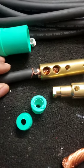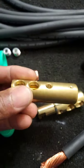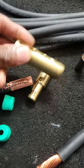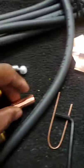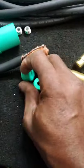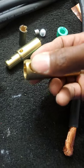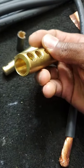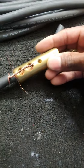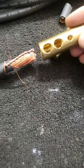Then you put on your hardware. This right here is brass — solid brass — and this is what actually connects the wire to your generator, your distro, all that. Before you put the brass fitting on, you've got this copper piece — it's thin metal, not really tape. To know how far to cut back the wire insulation, you look at the fitting, see where the screw holes are, slip it over the wire, and wherever it stops, that's where you cut the insulation back — so you get the right length for it to fit inside.